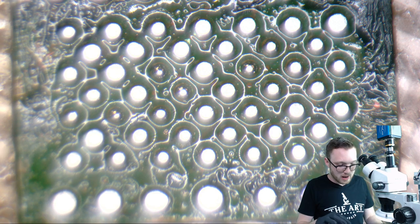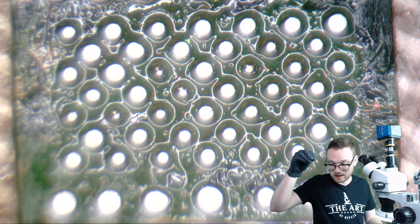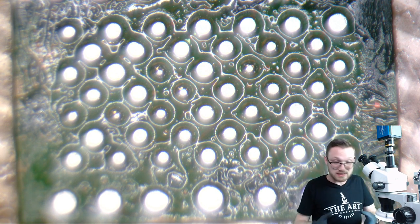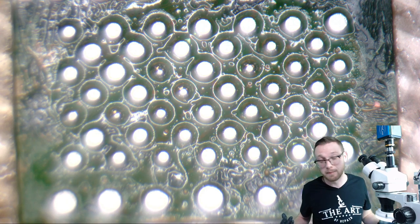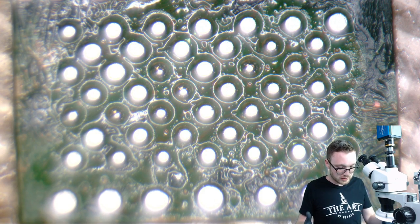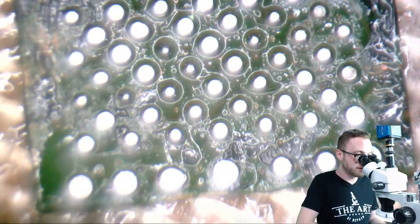Okay, whenever you're heating solder up, generally, second law here, it's kind of going to the lowest energy state. So the lowest energy state would be the point. Okay, a point of the ball is definitely going to wet faster than a big surface area like this. Okay, so we're going to take this one step further. Now that we've got everything perfectly proportioned, and not so much perfectly proportioned, but we have it the right amounts, okay? We have the right amounts in there. What we're going to do is we're going to heat up the chip again, and we're going to let this stuff reflow into itself.